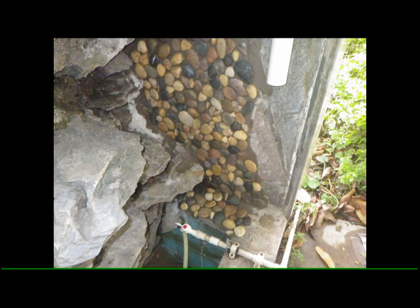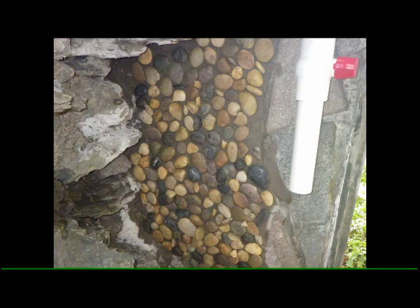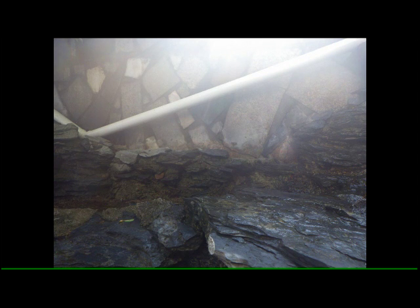Removing all the old lighting, the electrical panel, all kinds of wires that were hanging around there. There were all kinds of screw holes and different stuff all punched through the wall. So we waterproofed it all with some mortar, and then added all the decorative stone to just basically hide everything, and added a shut-off valve. New PVC tubing connected to the pump. Just get an idea of our lengths and where we're gonna cut everything.